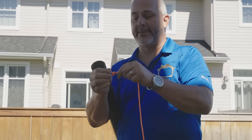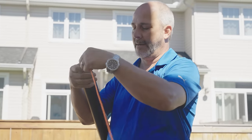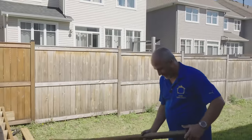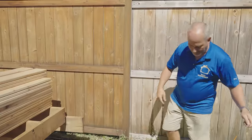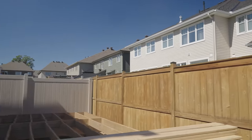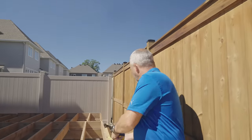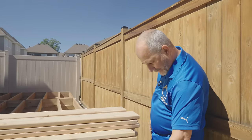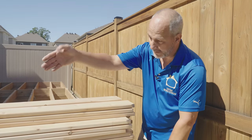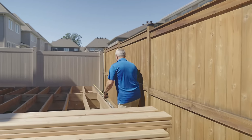All right, so I'm going to tie a deck screw to the end of my string, just so I've got some gravity working in my favor. I've got to go 12 feet. There it is. Got a coupling. And then I'm going to have one more piece of pipe, but I've got to measure that off first. So let's take the total length of the deck, which was 15 feet. We'll finish the pipe underneath the edge here, because then I can put a skirt on and have the conduit hidden.